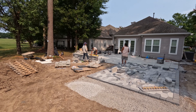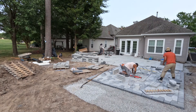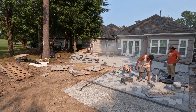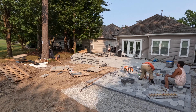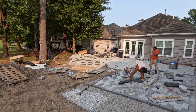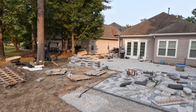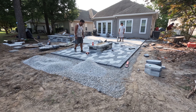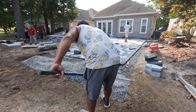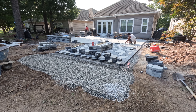On this side of the patio, we are starting our fire pit construction. We laid all of our pavers out over the area where the fire pit was going to go, and now we're starting to cut the perimeter out and start to stack the actual fire pit in place. One thing to note about the graphics wall is it goes in and out. What we do is pull out the ones that are all the same on the bottom course, lay those out so we can cut a perfect rectangle to build our fire pit. If you don't do that, you end up having to stair step and make awkward cuts in order to get the fire pit to fit around the pavers.